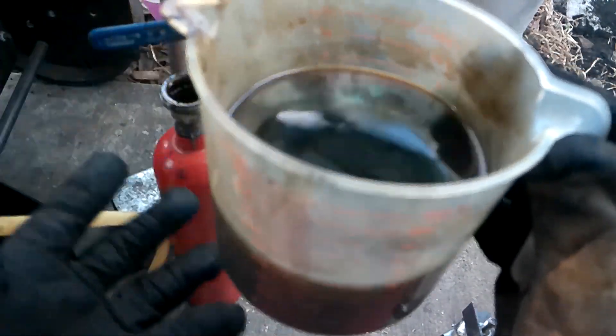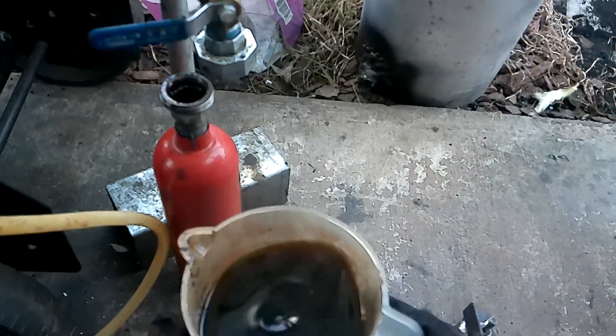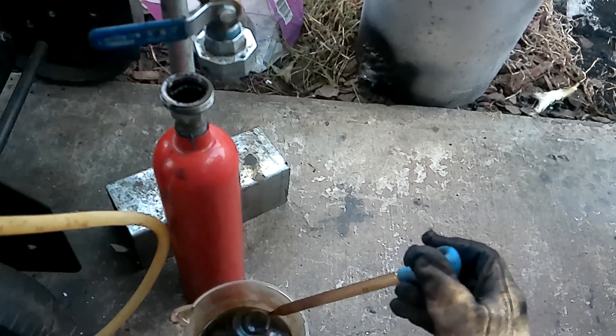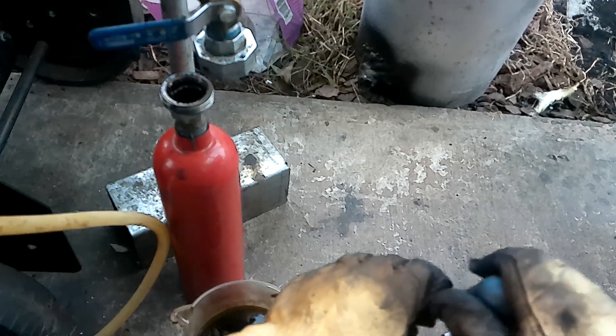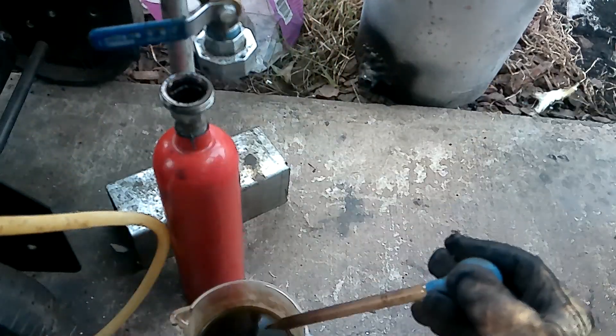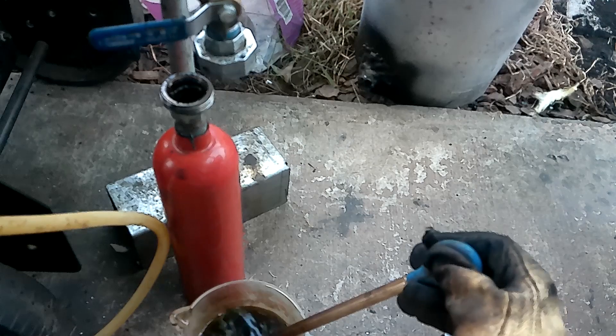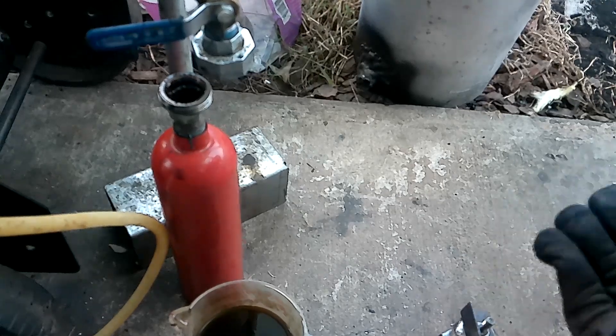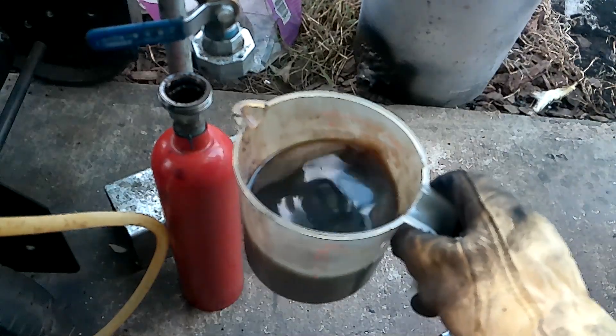This is 550ml. And you have to remember, when we get this oil from styrofoam, it really is low in water content. I can't even see where the water line begins, if there even is a water line in there. I can test with this pipette and see at what point it gets clogged. That doesn't look like water — well, maybe a little bit. So there is some water in here; there always is some. We're literally recovering the water from plastic, and that's not a bad thing. That's a good amount of oil.